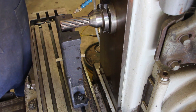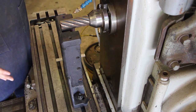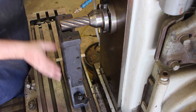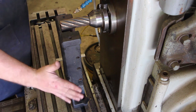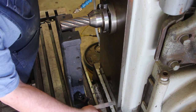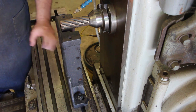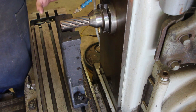We've got this set up now and we're about ready to start. My whole purpose is to clean up the surfaces on the sides of this stanchion. This is an original piece — not a raw casting. The bottom side where it goes down to the table was machined flat, so that's my reference for going up and down, and we'll be clamped to the table square with that surface. As for positioning in and out from the mill, I don't have a machined surface to measure with an indicator, so I just took a six-inch scale and got it to exactly six inches on each side — as close as I can get. There's a little bit of wiggle room since the bolt holes are slightly oversized, so I can adjust once I get in there.